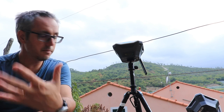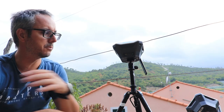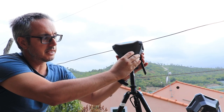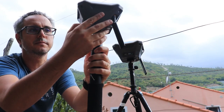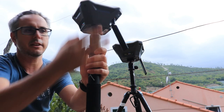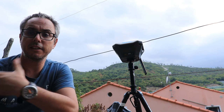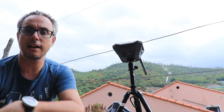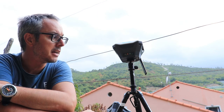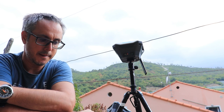Good. So what I like to do before I start any survey, this is something a little bit old, but I like to turn on my instruments and let them sit static for a while. I'm going to turn on this one too. Great. And let them sit static for a while before I actually start the survey. This is a good thing to do so they start seeing the satellites, initialize, and basically be ready to go when I start the survey.